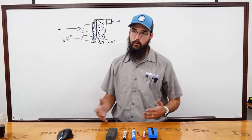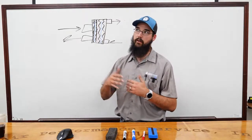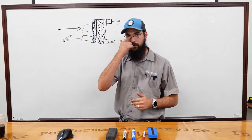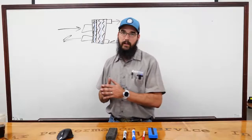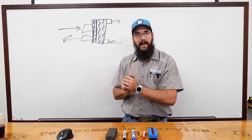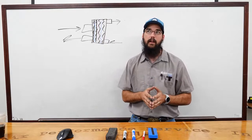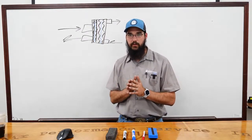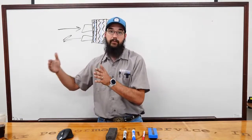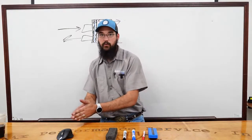Sales orders are extremely useful, especially when troubleshooting prolonged issues with any chiller. One of the first things I do is try to get the sales order or the initial design spec and get everything back to that specification, because that was the intended starting point. What I find is that systems tend to drift further and further from their designed operating conditions over time, and the further you get from that, the worse it's going to run.